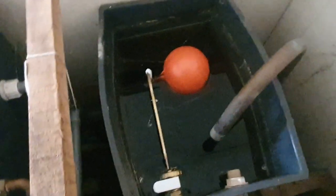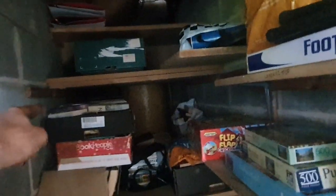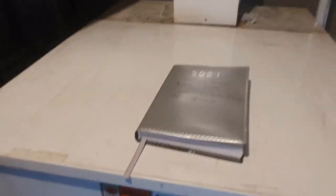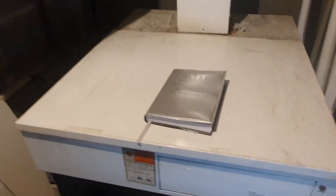The header tanks were upstairs on this flat roof bit, basically under this boxing. There must be a cylinder somewhere too, because we've got a domestic tank and then this is the heating one. The heating cold feed doesn't actually turn off - it just spins. That'll be replaced anyway. That's the heating vent that goes over the tank. I just need to find somewhere to isolate the supply. I've tied the ball valve up with a bit of old wire - I can't find the internal stop tap or the one outside. I've also disconnected the burner from the boiler to make sure it can't fire.